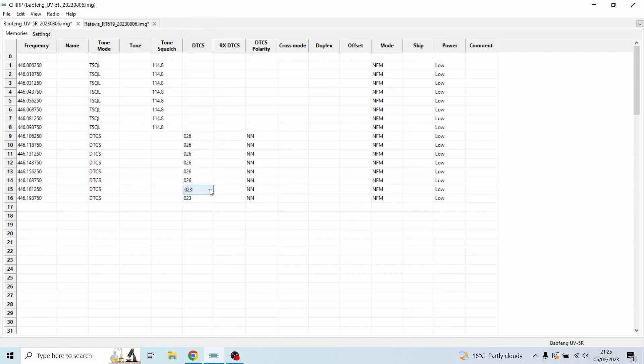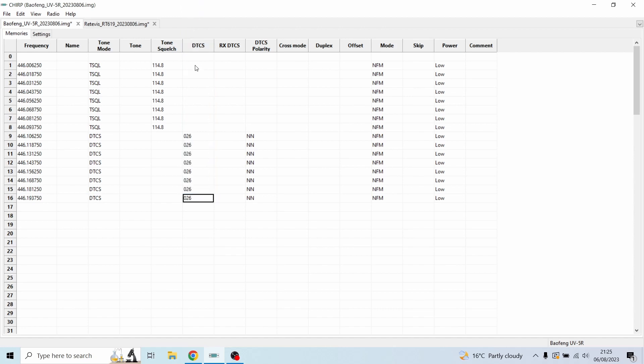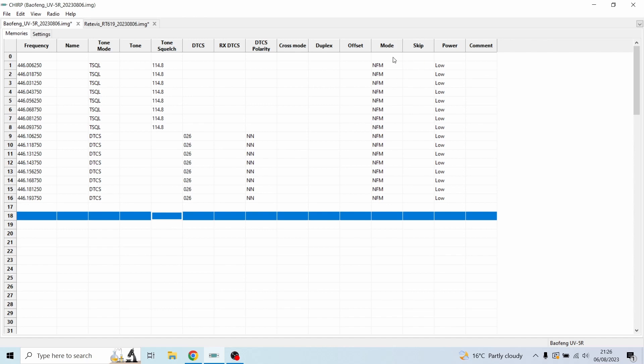This tone is what the radios listen for before they start receiving. If you don't tell your BaoFeng to use this tone to initiate communication, the other radios simply won't respond — it's like having to put the clutch down before you drive: you can turn the key all you like, but if the clutch isn't down the car doesn't know it needs to start. Now that everything is in place, disconnect the smaller radio and reconnect the BaoFeng USB cable, then turn it on to volume 100.